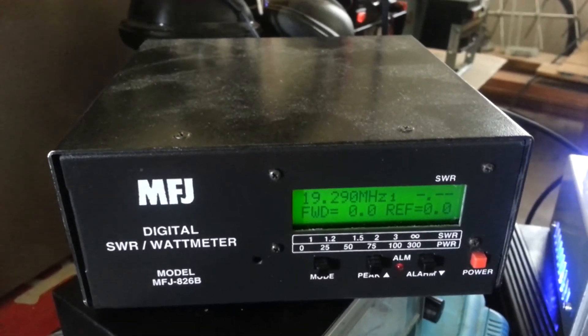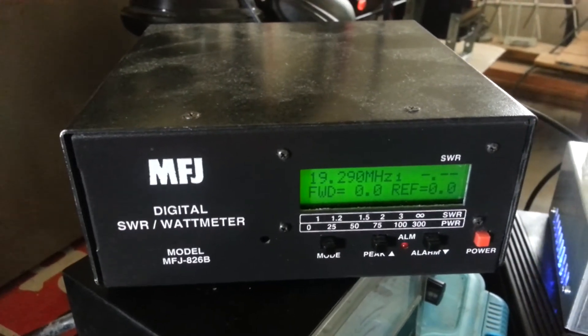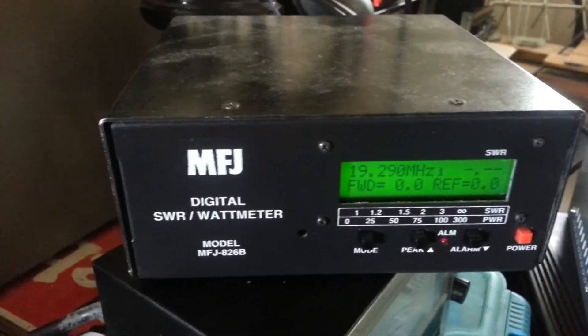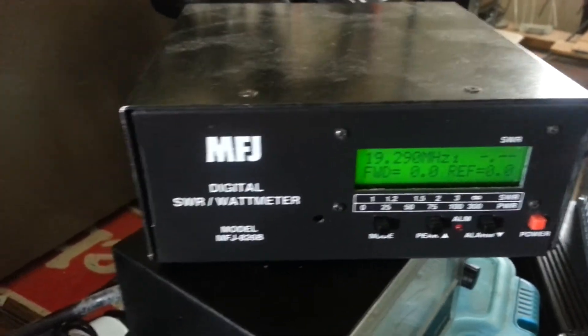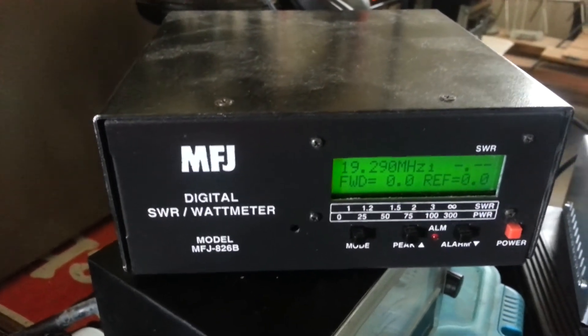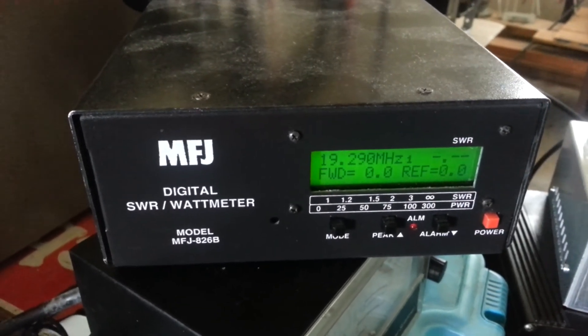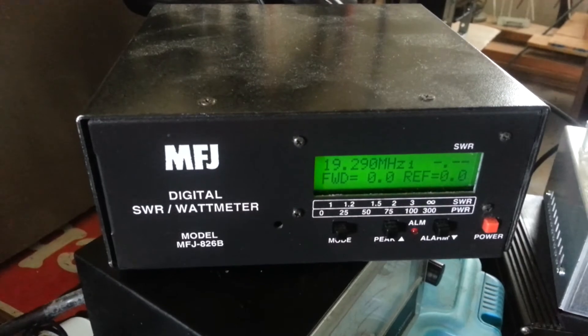Not bad — 13.8 volts, 230 watts all the way up, 160 halfway, and 80 all the way down. Makes a good driver for 4 pills or 6 pills, maybe even a little 8-pill. Won't drive it to the complete max but will push an 8-pill real well.